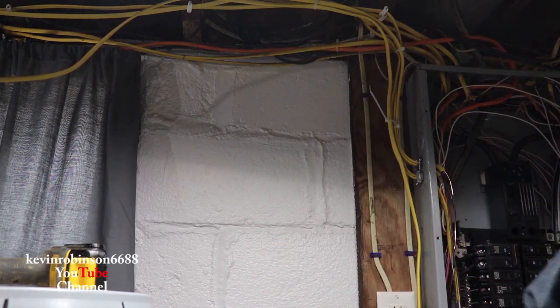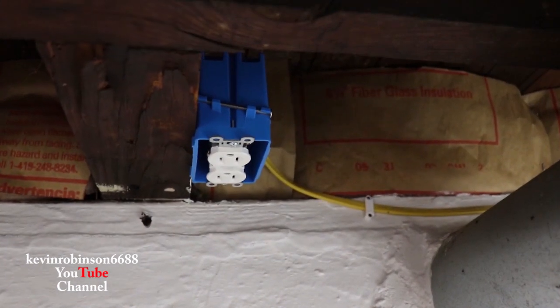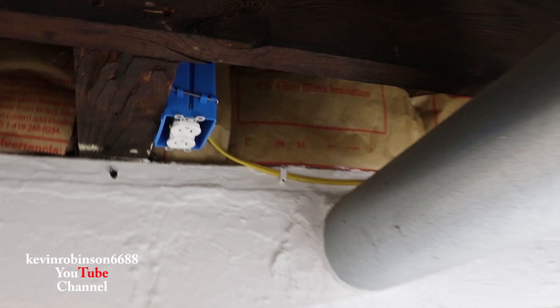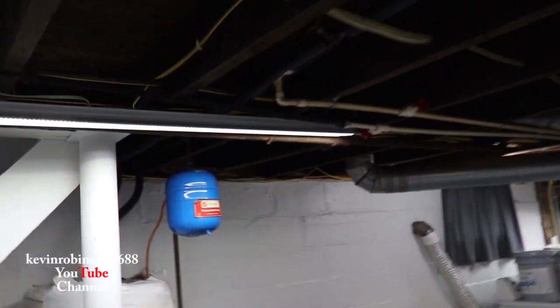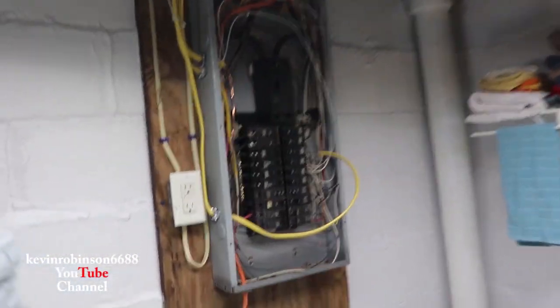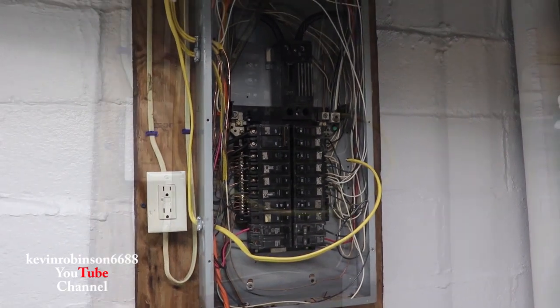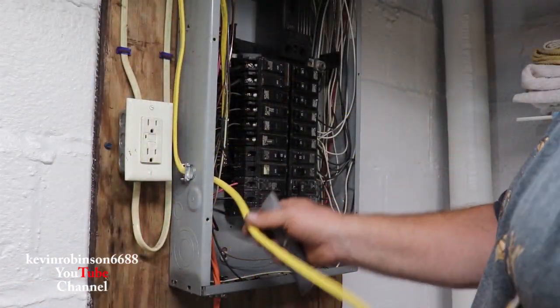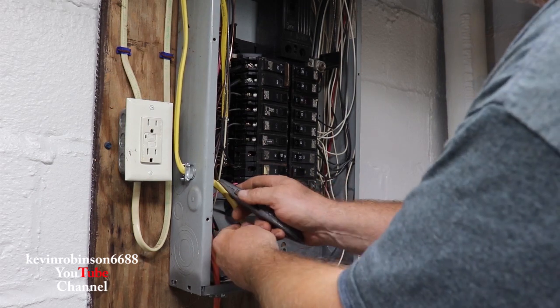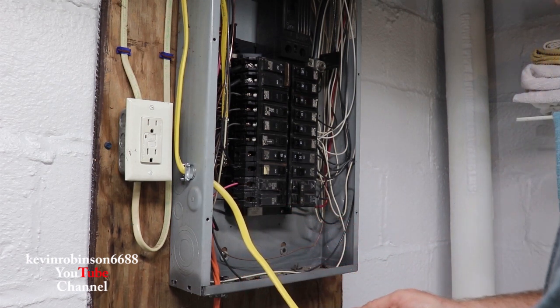We're going to work our way right down that wall using zip ties. I've got a receptacle wired in there and another receptacle wired in right there, but they don't have covers yet so I have to go get those. The wire is run all the way along the ceiling, through the same holes, all the way back to the breaker box. Now we're good to go ahead and start wiring up the breaker box — it's not a hard job, you've just got to be real careful. I'm going to strip this wire down with a carpenter knife, cutting right in the center — you don't want to go real hard, just cut the plastic coating on the outside.